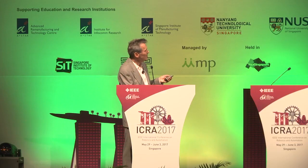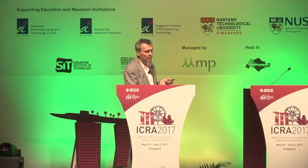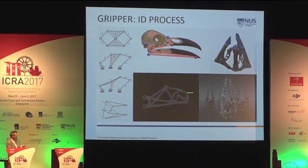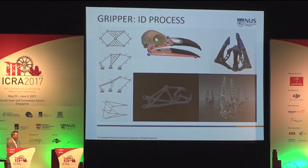Again, here you see students without the infrared markers, but previously they were wearing them in order that we can see the trajectories, and this robotic arm is so capable then of accelerating up to 18 G and has a payload of about 2.5 kilograms at a velocity of up to 700 degrees per second. The gripper for the front, I was also explaining today how one was coming from point to line and space gripping based on the linkages found already in the 19th century on birds' beaks.